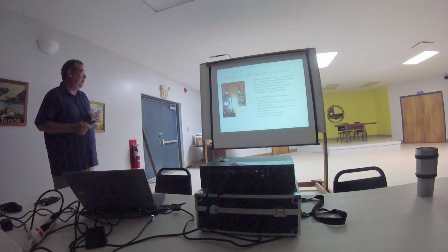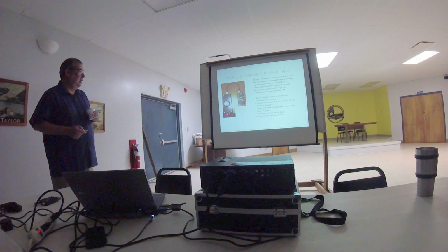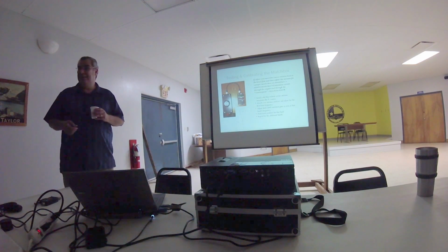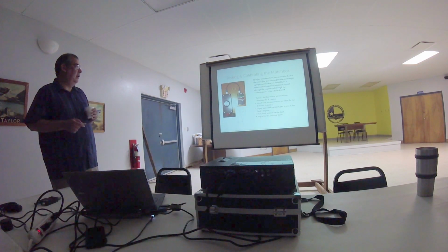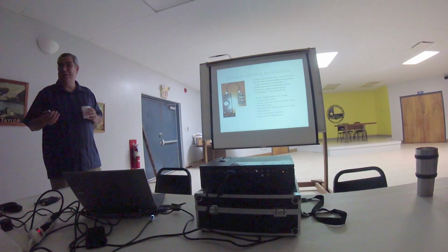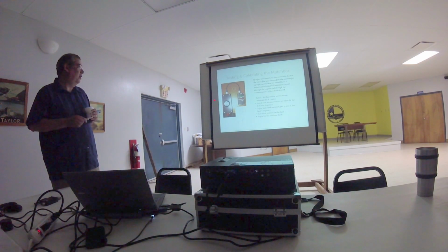back to a little discussion here about matching this. Essentially, you put a resistor here. In my case, it was a 4 k ohm resistor. Set up my antenna analyzer, set my frequency to my first band. In my case I was trying for 40. I didn't quite get 40 meters tuned in, but I did get 30. So I'm starting off at 30.